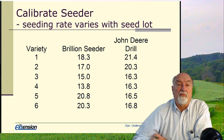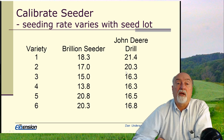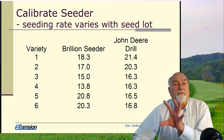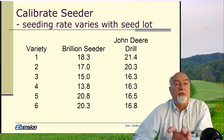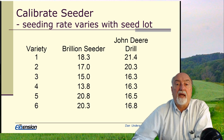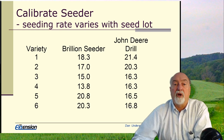Those varieties seeded from about 21 pounds per acre down to 14 pounds per acre. We did the same thing in a John Deere drill with the same setting and those same six varieties. Most varieties seeded at about 16 pounds per acre, but a couple were seeding up around 20 or 21 pounds per acre. We're probably not going to take the time to fully calibrate our drills, but I would suggest putting a third of a bag in the drill and seeing if you seed about an acre, or a whole bag to see if you seed close to three acres. If you buy two different varieties, you need to repeat the process for each.